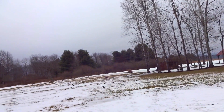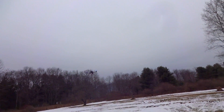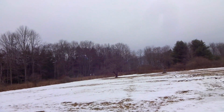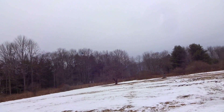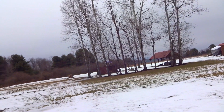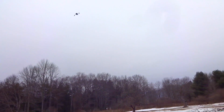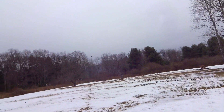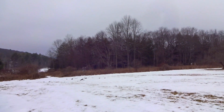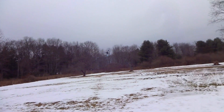It's definitely a very interesting flying experience. Going up into some higher rates — I did guess the tune on here but I still got quite a bit of bounce back. I basically just increased the values a lot since I assumed it would need more gains to help stabilize itself. It's honestly not as bad as I was expecting. These props definitely do help — the other ones did not perform as well, it's just too high of a load on the motor.